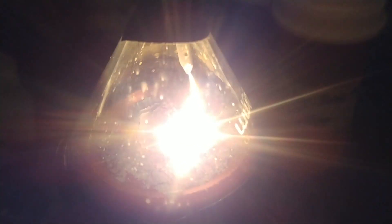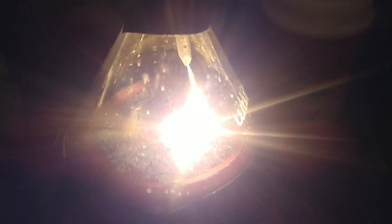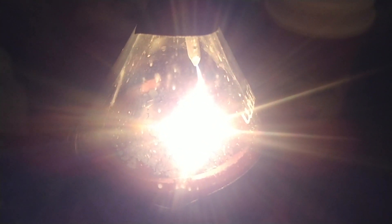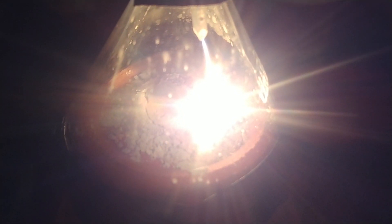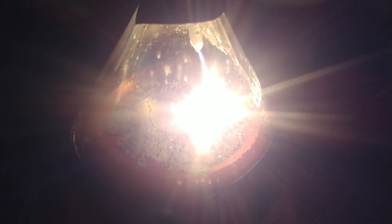It's really cool because it is actually fusing the chromium and aluminum oxides together and making red corundum. I'm able to keep it stable and form rather smooth droplets of this corundum. People kept telling me this wasn't possible to do, and maybe not in a practical sense, but now I know you can actually fuse alumina into corundum using a high voltage arc, and this really isn't using tons of power.